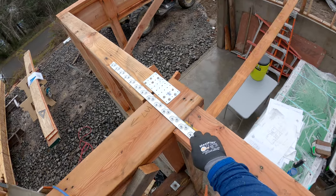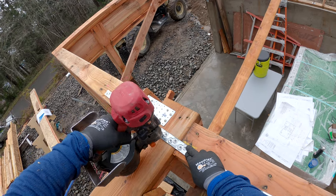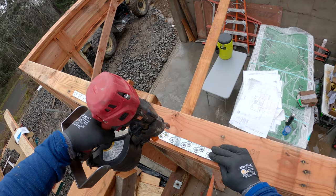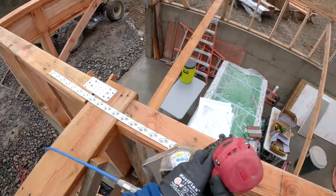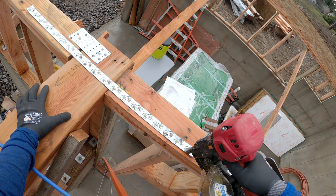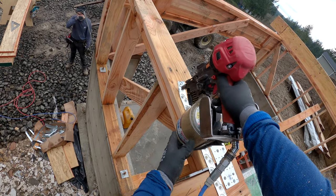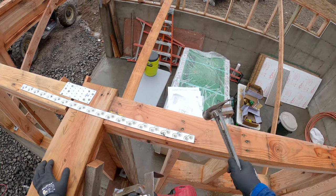There's a variety of things you're seeing here, and it's not going to really make a whole lot of sense. Basically, the 2x8 wall there needs sheathing. We didn't have it at the time, so we put a shim in, gapped the plate off the front, and attached that with a Simpson TP37. What I really want to show is the Strong Tie CSHP coil strap that is designed to be used with your pneumatic nailer. I'm attaching two different shear walls across another shear wall, and the tension tie was just the simplest way to do it. Just know that it's very structurally sound.